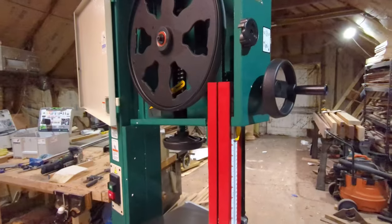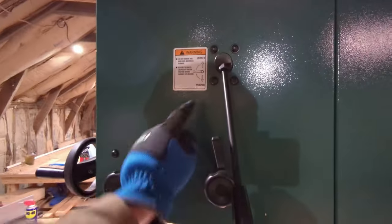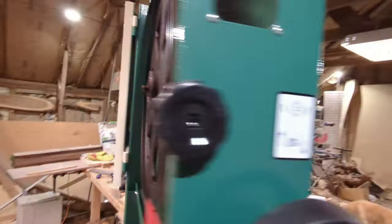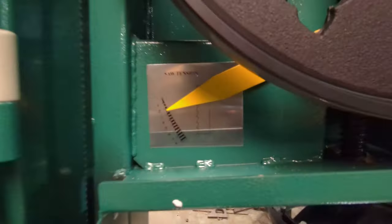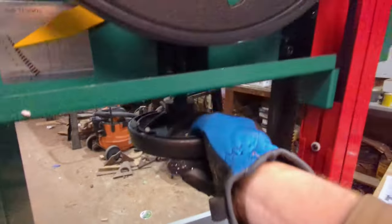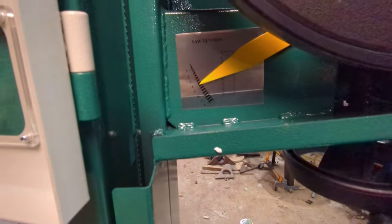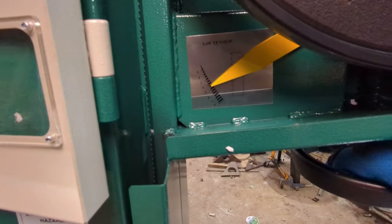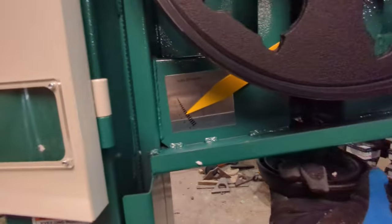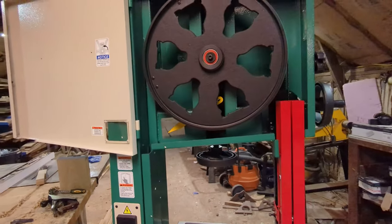You can see where the blade is and where the bearing is — you don't want them touching. Once you've got the bearings away from the blade, re-engage the blade tension. It shows you which direction to tighten. Then add tension until you get the indicator between the four and the six on the scale. The tension knob is right down here — as I spin this, the little lever moves, confirming I'm tightening the blade. I got it right at about five, which is between four and six.